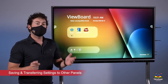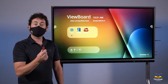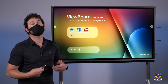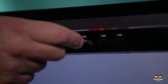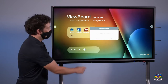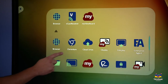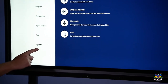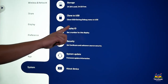Now that we have all the settings configured, like the Wi-Fi and Eco Mode, we can clone those to a USB stick and then install those settings on other boards so we don't have to repeat the same process over and over again. To start, plug the USB into the front of the panel. You'll get a notification to open folders — touch cancel for now, and touch the down arrow to get back to settings. Choose settings, then choose system from the list. From there, choose the clone to USB option.